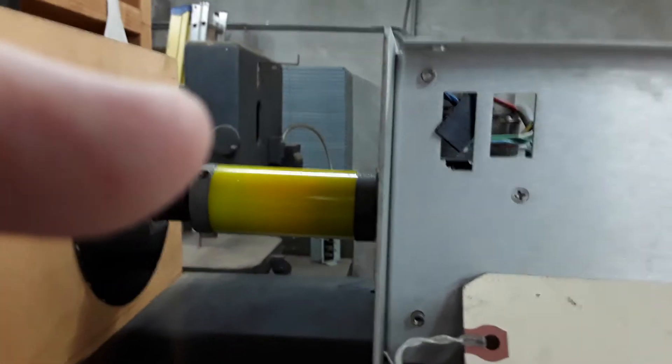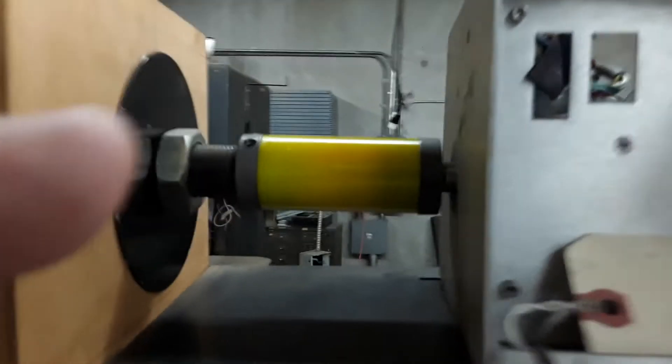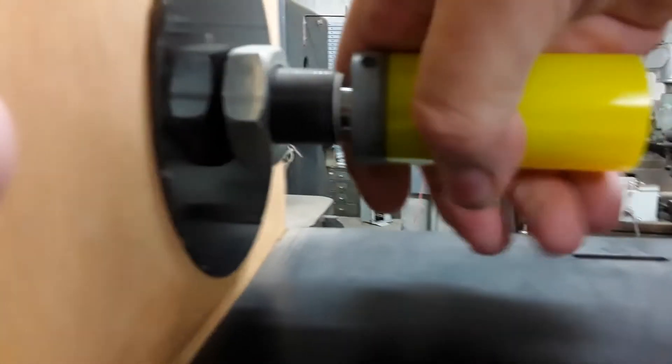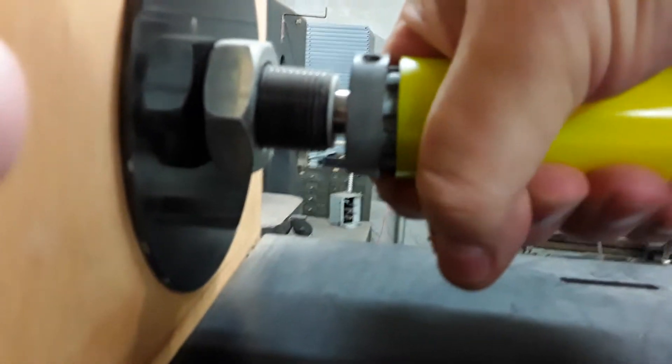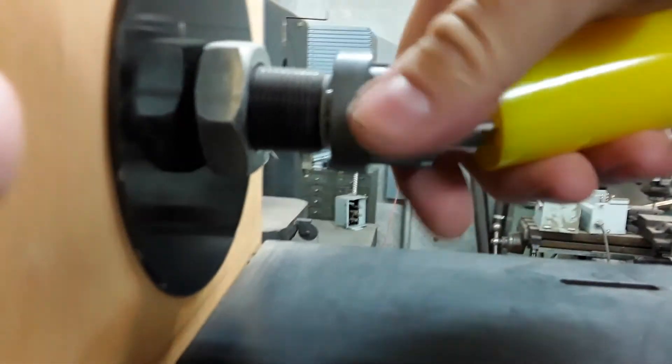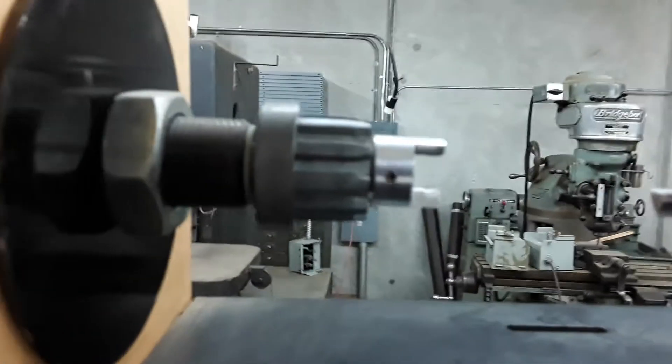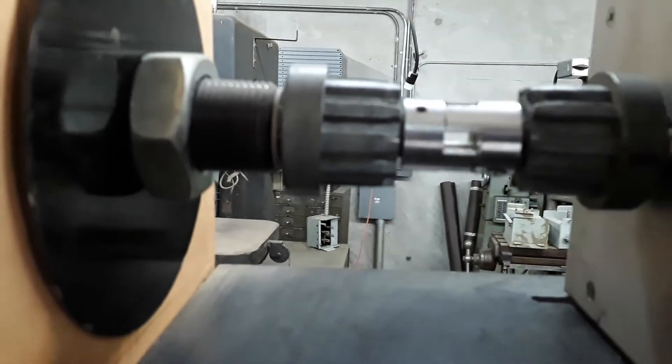Underneath the clock drive, the shelf will have four Allen screws — they're 5/32nds. Once you get those out, pull the drive back. Pull the coupler off for the hour shaft. What you should see is that the minute shaft coupler is either missing or there's just dust in there from where it's corroded and broken up.